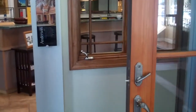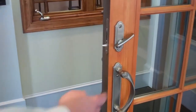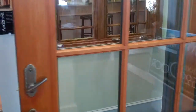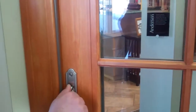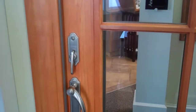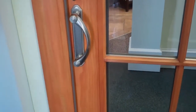The hardware on this gliding patio door is stainless steel — both the track and the roller — giving it high durability and high performance and making it easy to operate. The locking system actually draws the unit into the compression weather stripping, making this a solid connection with the weather strip and eliminating wind and water from infiltrating your home.